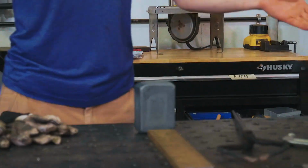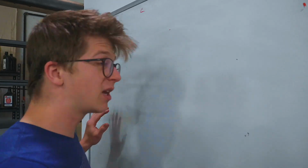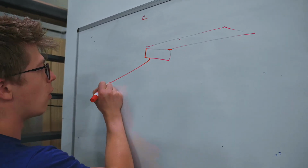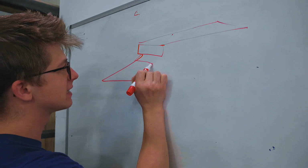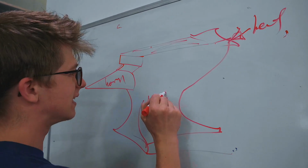This rectangular block of steel, you're asking yourself, how does this look like an anvil? Alec, it looks like an anvil like this. So obviously you're familiar with a normal anvil shape. Now the London pattern anvil has one horn. It usually has a cutting table here, swoops down and around. You have face, heel, horn, waist, foot.